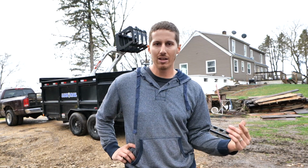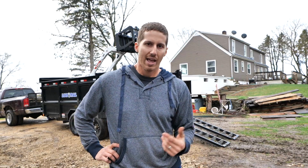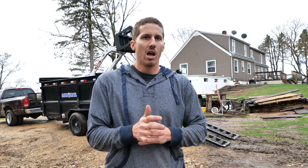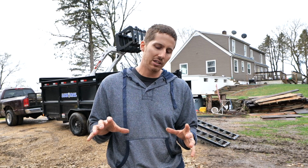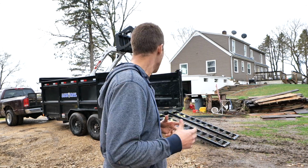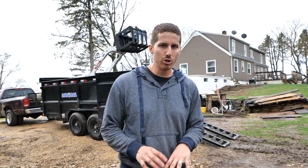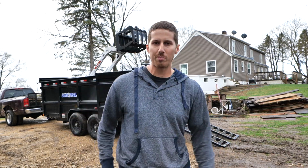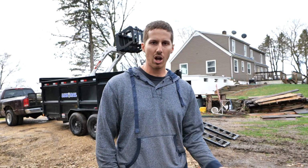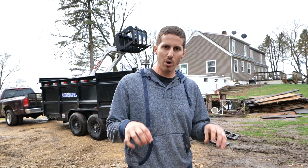Now, on my flatbed trailer, I had this problem with my other tractor. It's an older tractor, and I had to back it on because that's where the weight was. As I would back onto the trailer, my wheels would be spinning, so I took expanded steel and welded strips of it up there, and it was able to bite much better. You could do that on this. This is steel, so it's possible, and all it needs is a couple spot welds. Grind off a little paint, put a couple spot welds, put some expanded steel right there, and now you've got a nice bitey, grippy surface.